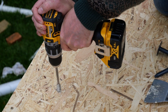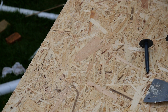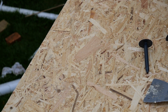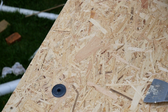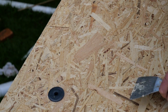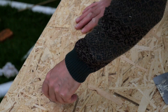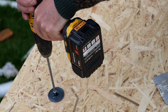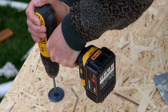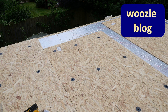We're going to be using thermal broken fixings. What these do is they separate the screw from the outside so that heat can't transfer up through the metal from the inside to the outside. Firstly you need to drill a hole in the wood once it's over the insulation, then insert the plastic insert, and once you've got that inserted you screw in the screw. This will go down through the original deck by about an inch or two and a half centimetres. You'll need 9 to 12 fixings depending on the wind conditions. On my website at woozle.blog I'll leave a list of the materials we used and the suppliers we got them from, along with detailed instructions.